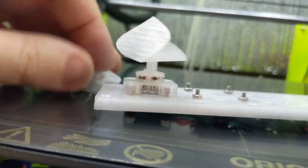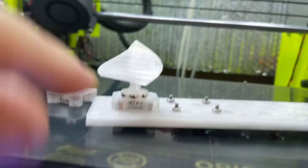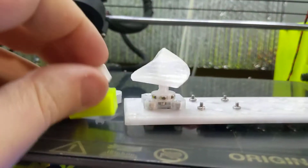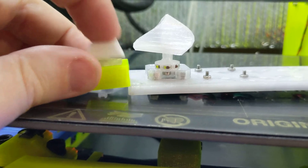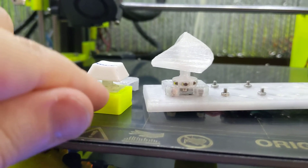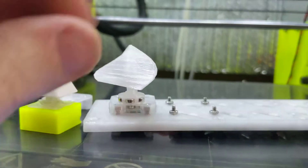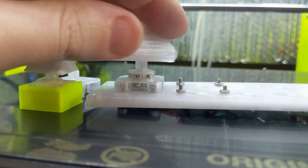The other benefit is that the whole knob comes off. So if you imagine the top plate will have a little hole in it for this little shaft to poke through — this is about the same height as a key switch. You can see it'll sit right above the plate right about there, so there's plenty of room. I just need a little six millimeter sized hole, a bit bigger for tolerances for the shaft. And when I magnetically pull the whole top plate off, the shaft will come right along with it, which should be really nice and convenient.